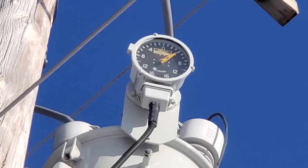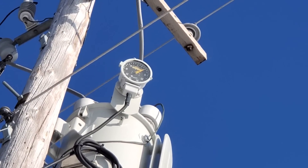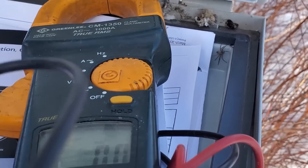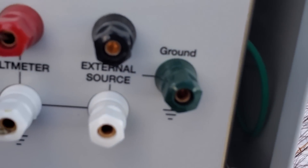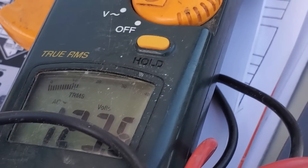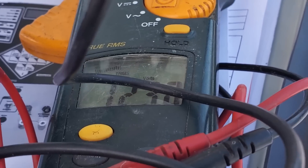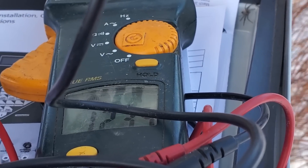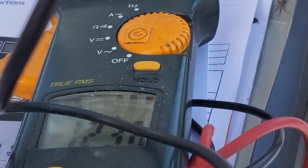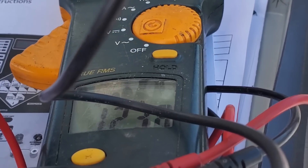When I say tap zero, we can see on this analog dial the zero, and it can go up or down 16 taps — it's currently on tap four. So the voltage coming out of the load side of this unit is slightly higher than the input side. We're going to check the current voltage with our multimeter using the access ports here, and we've got 123.6 volts currently. The voltage setting on this device is 124 volts, with a bandwidth setting of 2.5 volts. If this voltage goes outside that range — 124 plus or minus 2.5 volts — that's when this unit will auto tap.